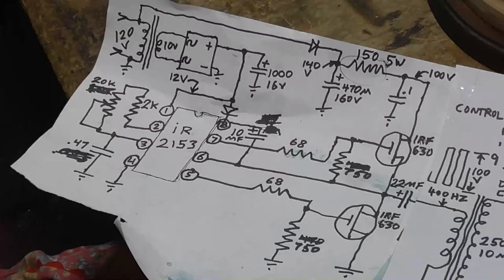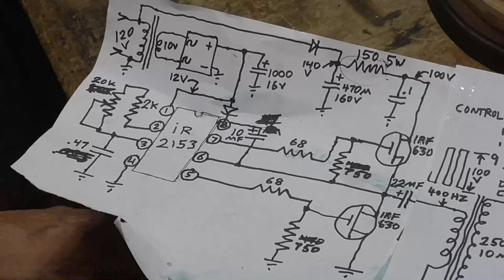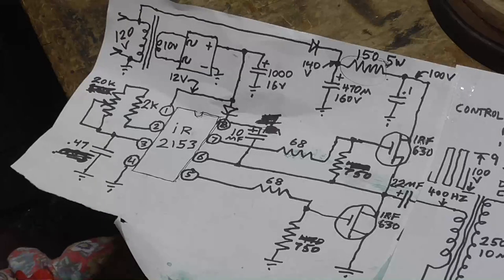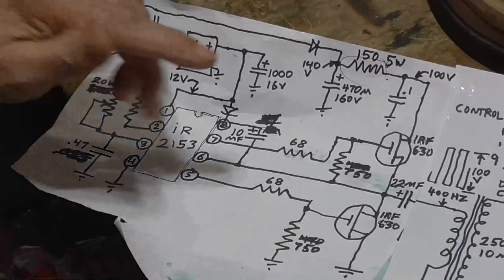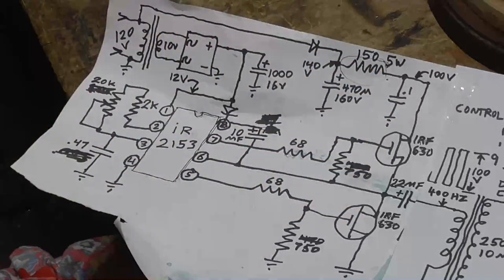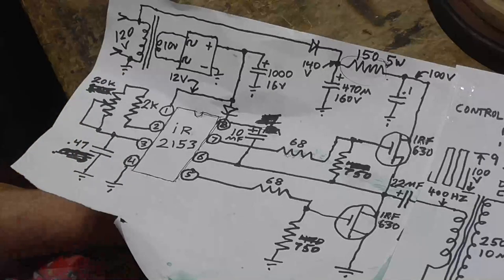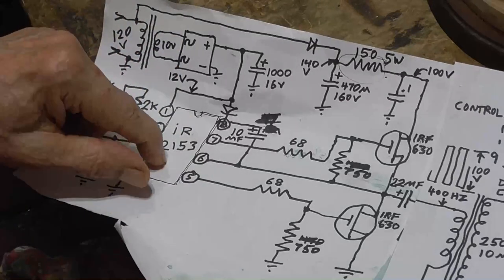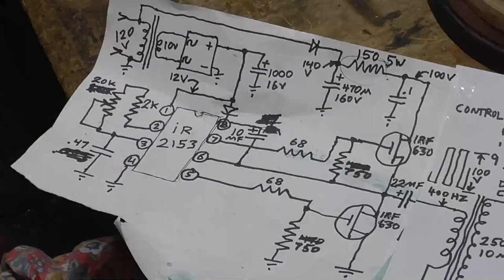You can go higher than 100 kilohertz with it. It'll run at 200 kilohertz, but it will have trouble driving FET gates at that frequency. You can drive smaller FETs, but if you want to drive usefully sized ones, this thing's going to have pretty slow rise times. At that kind of frequency, you're not going to have a very sharp waveform. So stick to 100 kilohertz and lower if you're going to use this device and expect to have good efficiency, where your FETs don't get scorching hot.